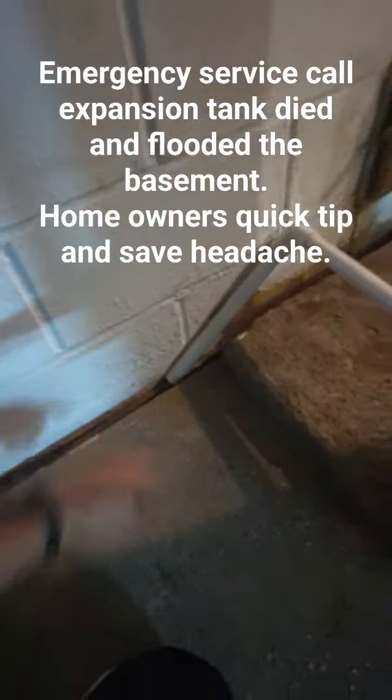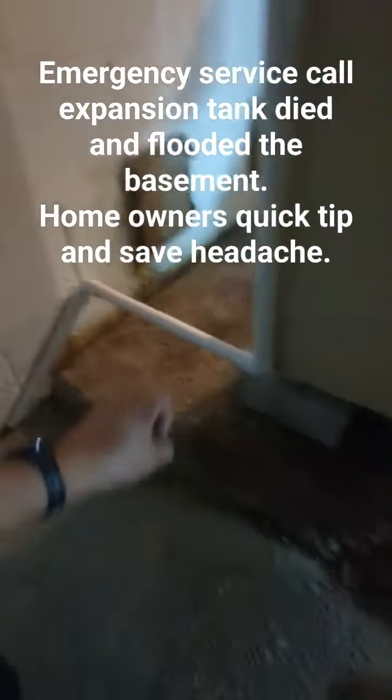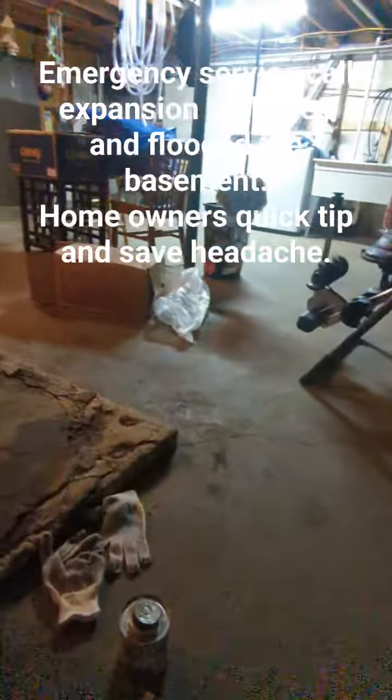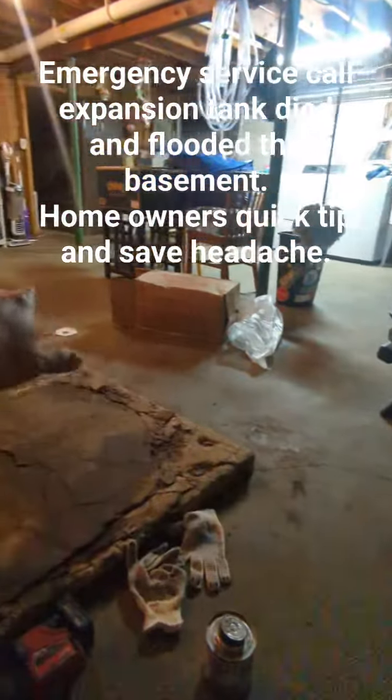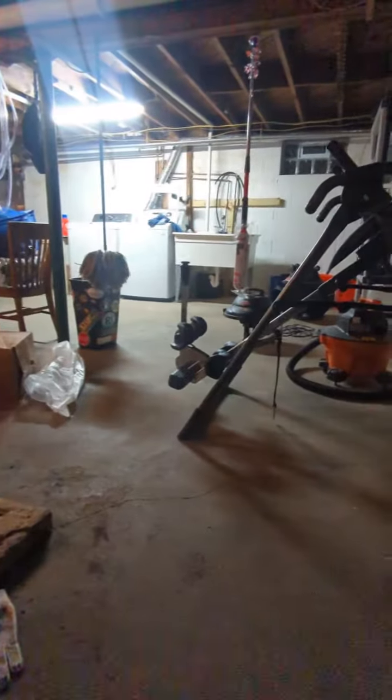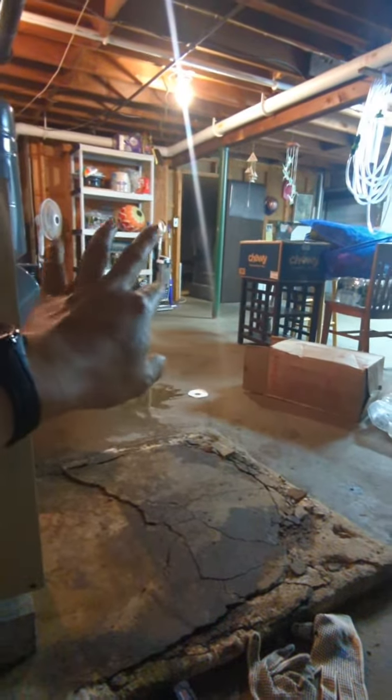Before, it was just sitting here, as you can see right there. So we decided to move it — put an elbow to go to the French drain. The reason is because when this one blows water, all the water goes that way. The slope is in the other direction and the sump pump is in the corner, so it didn't work — all the water goes to that side where the finished basement carpet is.